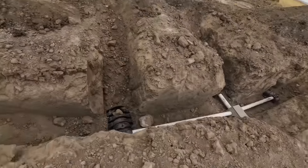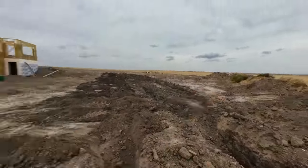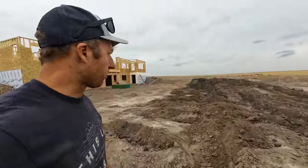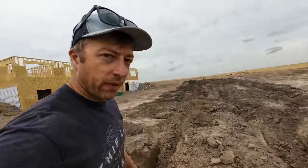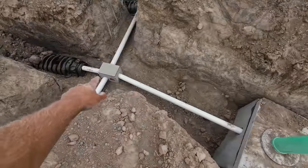Check it out - three 100-foot runs of 22-inch wide by 4-foot chambers. I got them level with the laser grade, perfectly straight all the way across. Just lightly put some soil on top to bed them. I'll come back in with the box grader and level this whole pad out, make it nice for the topsoil to come back. That's done - and honestly it's overkill for this house. For the three bathrooms we have I don't foresee us maxing out the capacity of this drain field - 300 feet is enough.